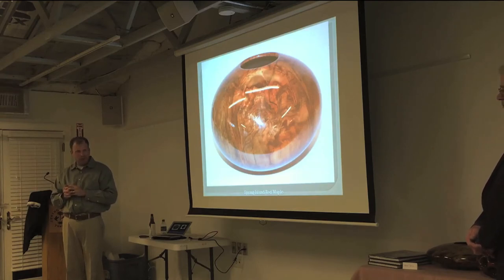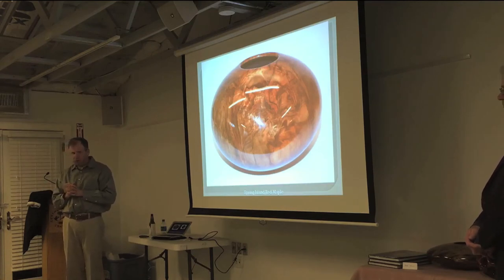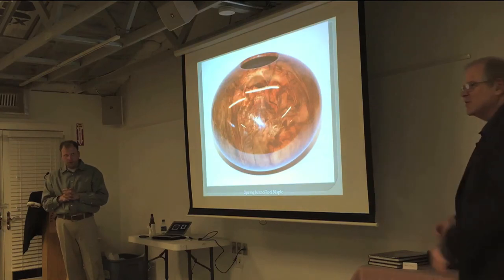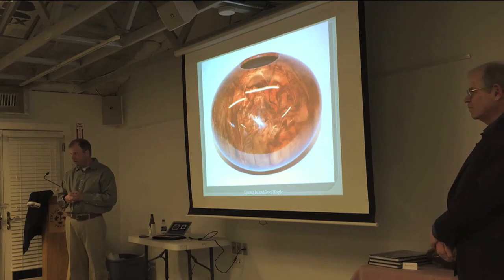I think walnut doesn't spalt. Sometimes sapwood can spalt on certain woods, but to spalt all the way to the center, your maples and hackberries do the best. Cedar does not spalt. The white outer part can a little bit, but the red center, that's never. Probably the sapwood. Yeah, anything in the conifer family would do it. You cut a series of these.